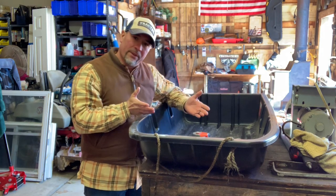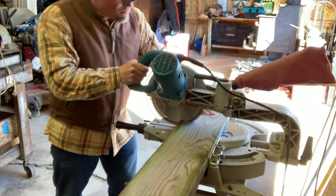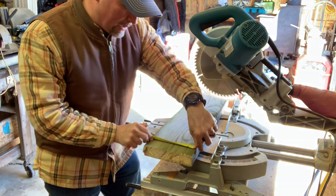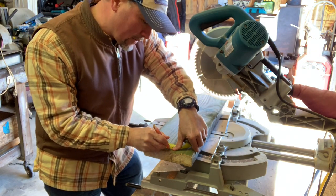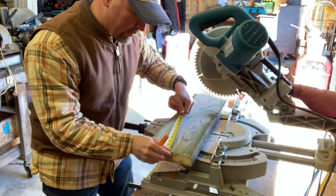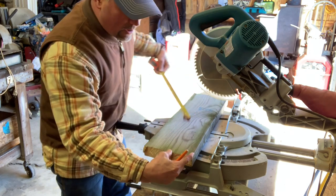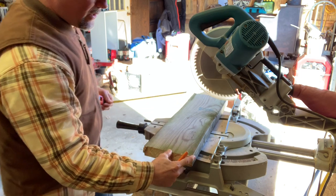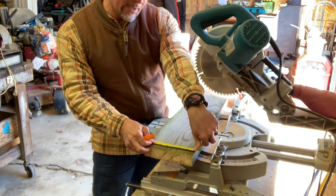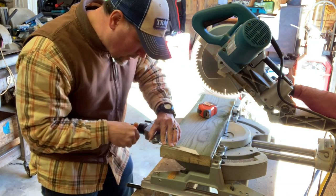So what I'll do first is cut this board into two boards at 24 straight and then put the angles on them. I measured that pocket and it's three and three-quarter inches deep. So at that height, that's where my 24 has to be - 24 by 24 all the way across, or actually 24 and a quarter. Remember this is sticking out about three and a quarter here - that's all I'm gonna stick up above that pocket. I'll find it from the bottom up to where the pocket starts at three and three-quarters - that's where I'll start my angle cut.